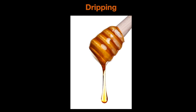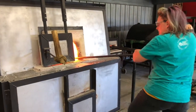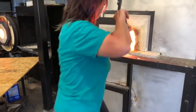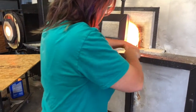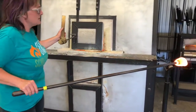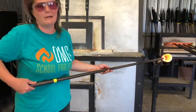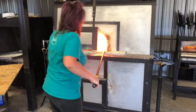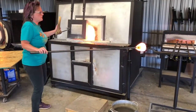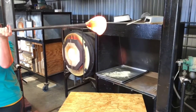For our third demonstration on gravity today, we're going to actually drip the glass off of the pipe. We've been talking a lot about how we're always turning to keep it on center and to keep the glass on the pipe — well, we want to show you what happens if you actually stop turning the glass. Here I am gathering up — I've got two solid gathers, there's no bubble in this. We're on a punty pipe and we're just going to get a large amount of molten glass on this punty rod. For extra fun, we are going to drip it on wood, because if you can create fire with molten glass and wood, why not?